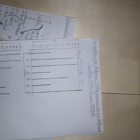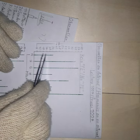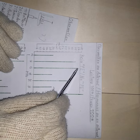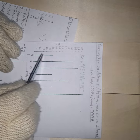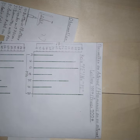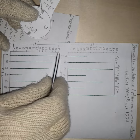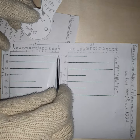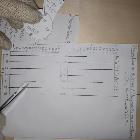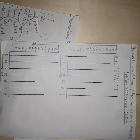Here are the results of my antenna test. In the first test without the wall outlet ground connected, the frequency we want to broadcast on is very weak. The first harmonic is strong and the second harmonic is even stronger — so it's transmitting more on harmonics where it's not supposed to, rather than on the intended frequency. At 84 MHz we also get a signal, and it goes very strong on the 2 meter amateur radio band. After adding the wall outlet ground, it changed heavily. Now the antenna is transmitting mainly, not the wires resonant at higher frequencies. There is a strong signal at 21 MHz, still a strong signal at 42 MHz but slowly creeping down. However, the overall diagram is U-shaped, which is not how it's supposed to look.